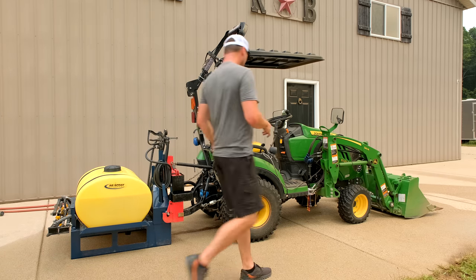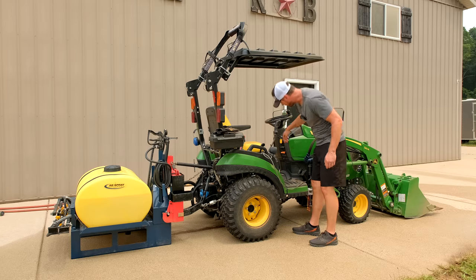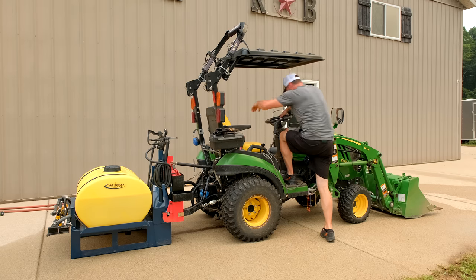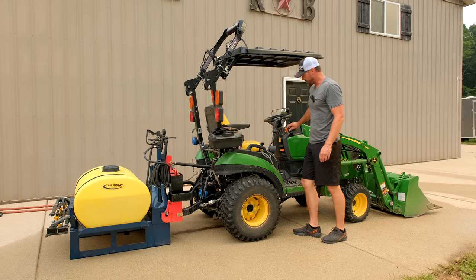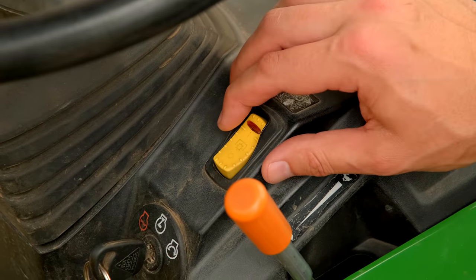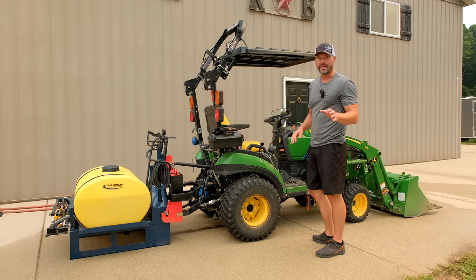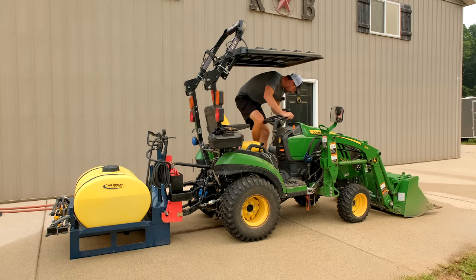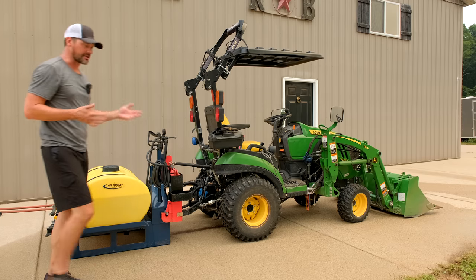To operate the rear PTO when you're off the operator seat: turn your tractor to neutral range — not high or low, but neutral. Make sure your parking brake is on. Set it to low idle with the PTO off, then turn the tractor on and push the PTO button all the way in to the detent position — not just on, but way in there. Then you can throttle up and you're good to go. Note: if you get back on the seat and hop back off, it's going to kill the engine, so you'd have to repeat that whole process.